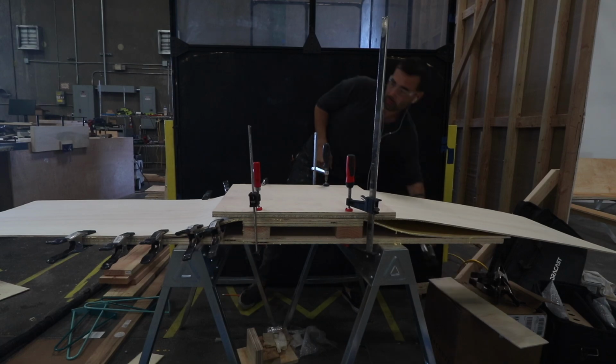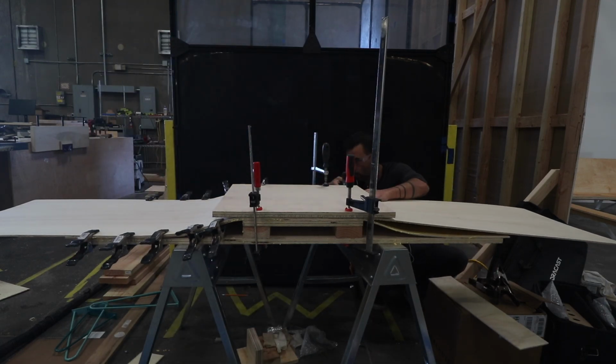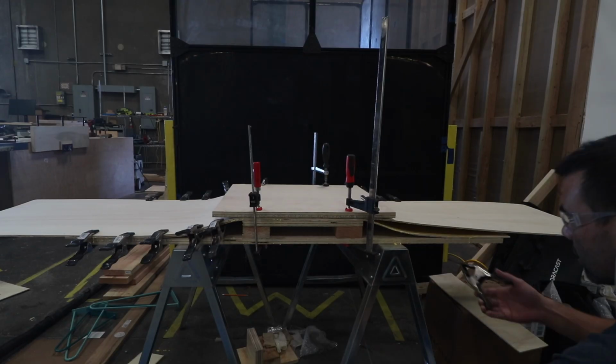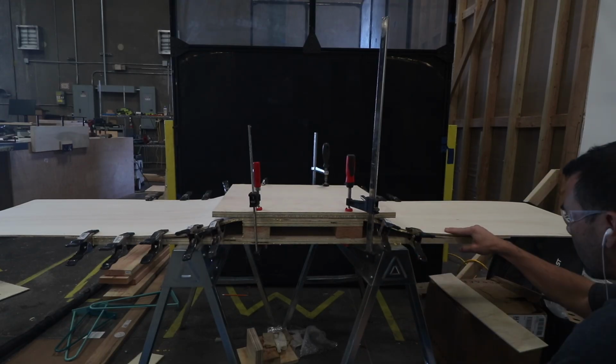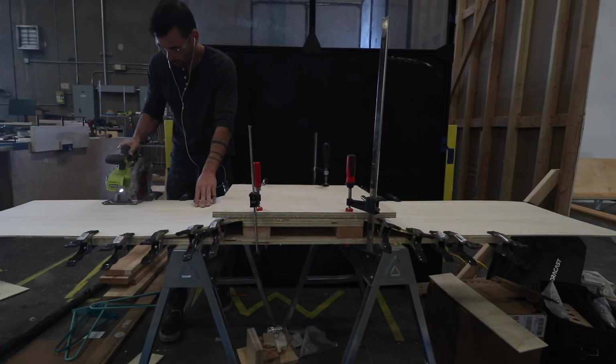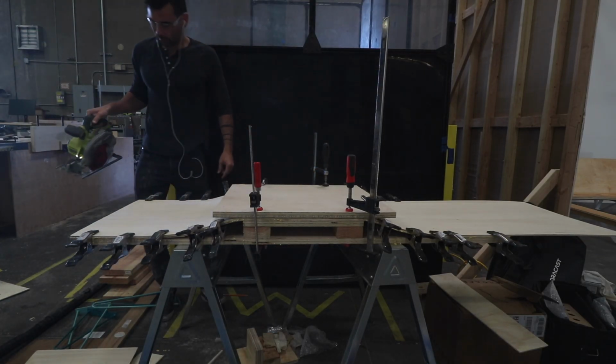Once again, I applied the spring clamps, but in addition to clamping the thin plywood to the thicker plywood, I also clamped the 2 thin layers together on the bending parts. In retrospect, I way overestimated how long the 1/4 inch thick sheets of plywood should be.